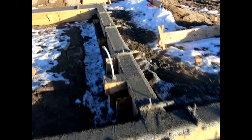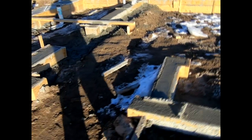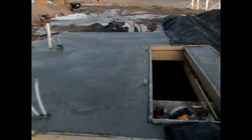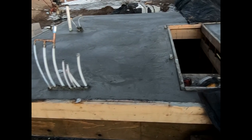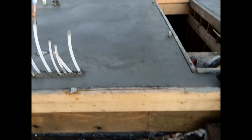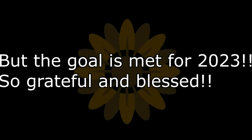We have to cover all this concrete with some curing blankets so that it cures more slowly — that's important this time of year. I've got to wait till Robert gets here to lay the blankets over this because if you're not careful and you slide the blankets over it you can scuff up that green concrete. So I need Robert here so we can gently lay the blankets over the top. The pilings were filled as well — almost done.